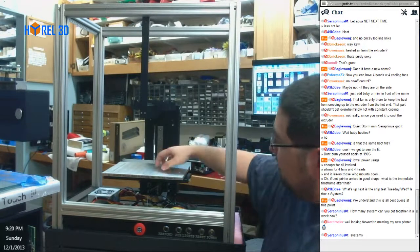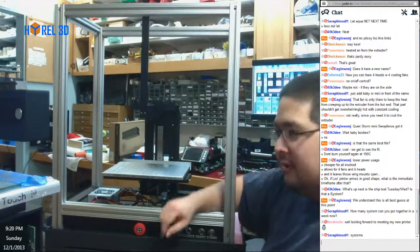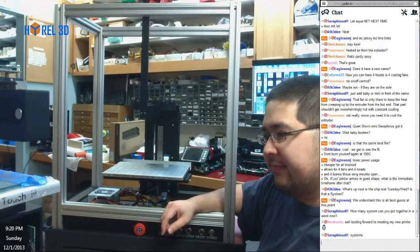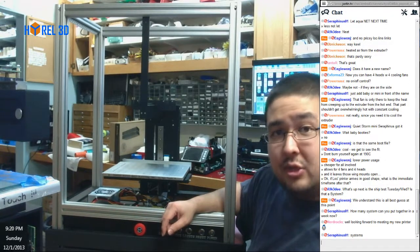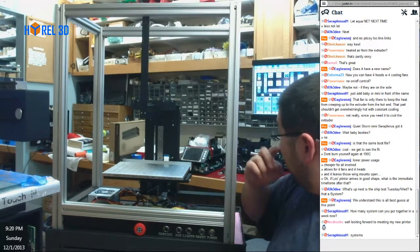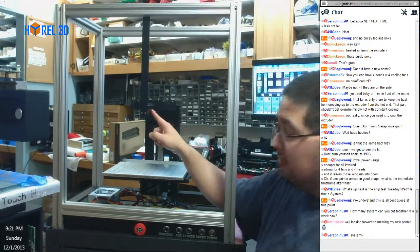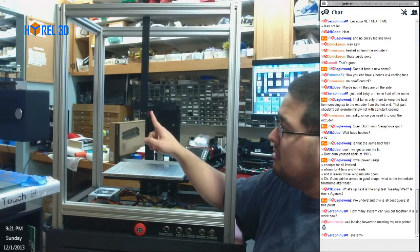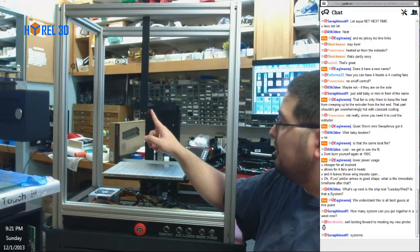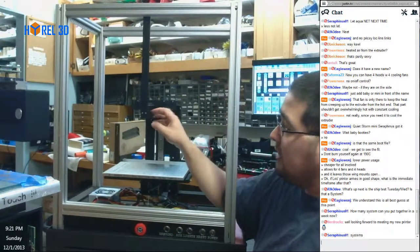It took us another 15 minutes. We haven't done the time study on the X-axis arm, but we have done it on actually installing it on here, which took us roughly about 45 minutes to put it all together, making sure that it's square, that it sits correctly and is properly seated, and square with your linear ball screw right here, and square everywhere else. Then we did the Y-axis arm that you see right here. It took us another, I want to say, 30 minutes to put in, making it square, and installing the last couple of pieces here.